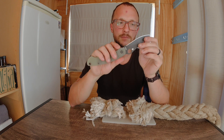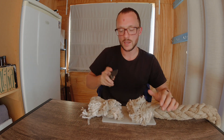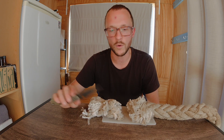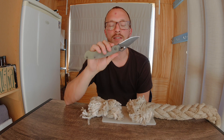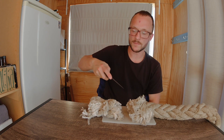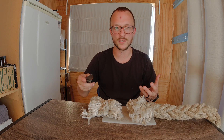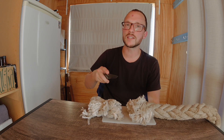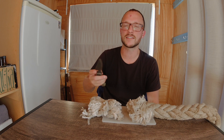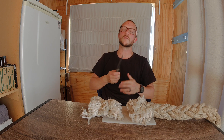That said, if I got through those last fibers and tried to use a little more of the heel or the tip because there's a bit of edge life left there — which I've done with all of the knives — the ones that won't cut just won't cut; they dull at the tip, they dull at the heel, they're dull everywhere. With CPM M4, when I came to those areas, because they had touched other parts of the rope, they weren't that much better; the wear resistance obviously wasn't as strong. Whereas with Maxamet, switching from the belly of the blade to the tip or heel once again had this really aggressive sound of sawing through really aggressively. That kind of confirms a bit of what we already know.